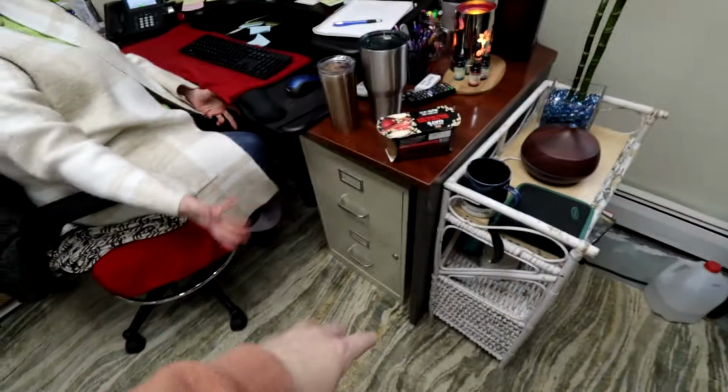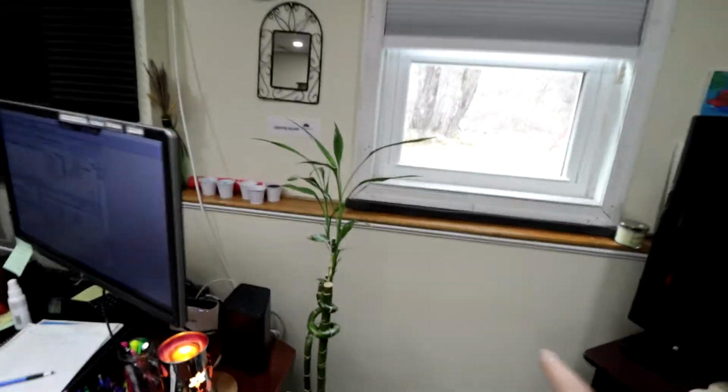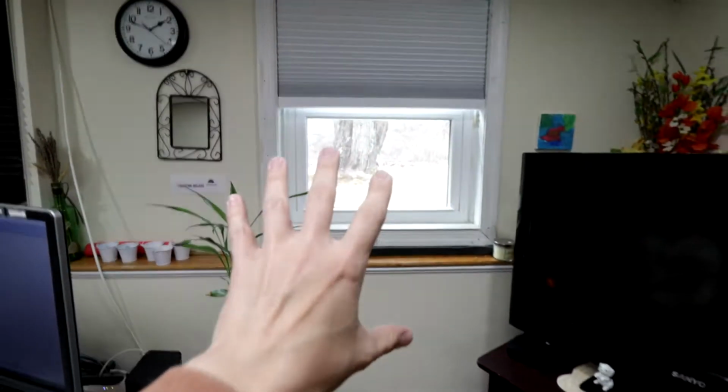Obviously cold air falls, but also, like I said earlier in the video, it's getting trapped behind this wall cavity and hitting the back of the drywall or the back of the sheathing or cement, and it's just going straight down and finding any cracks at the bottom and just coming out. Just this one penetration can cause you big issues and cost you a lot of money. Right. And nobody told you about that except for me.